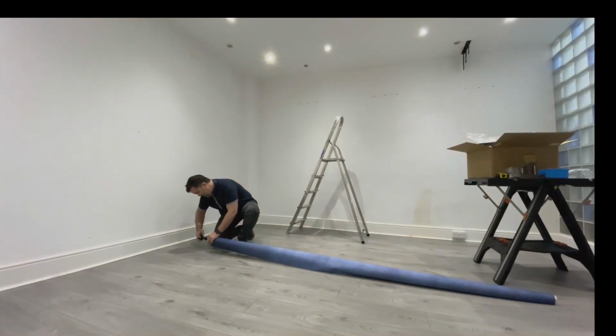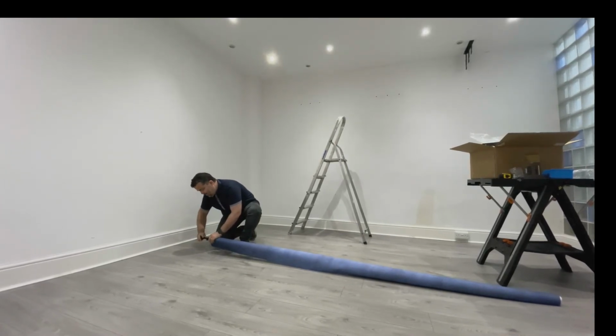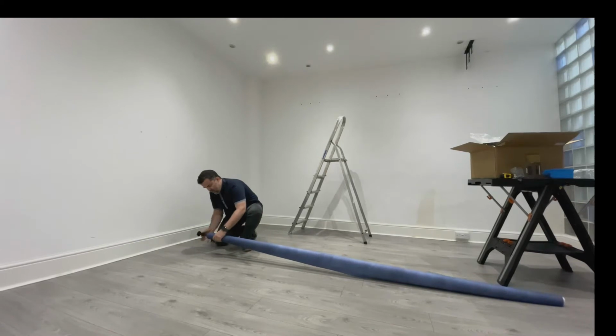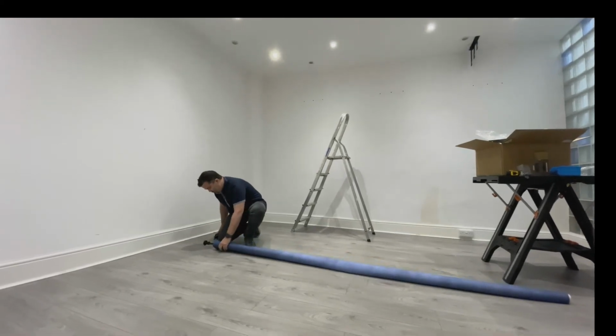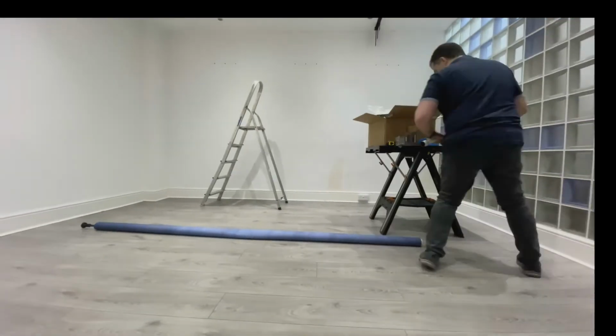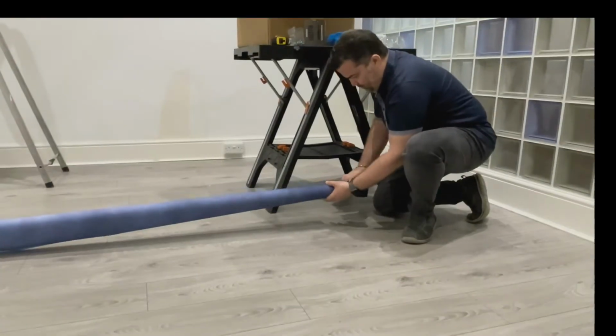Now the nice thing about the non-motor expander is you do have some wiggle room if you are a little bit off with your bracket. As you see this clip here, you've got some wiggle room there. Not a problem if you are an inch or so off in your measurements. Motor side goes in on the other side.